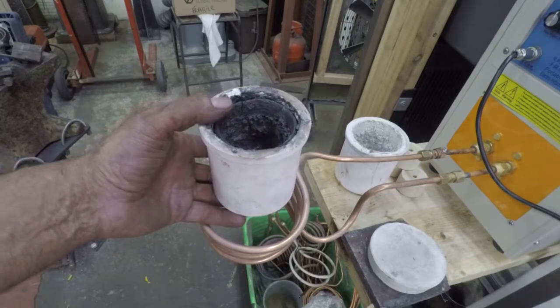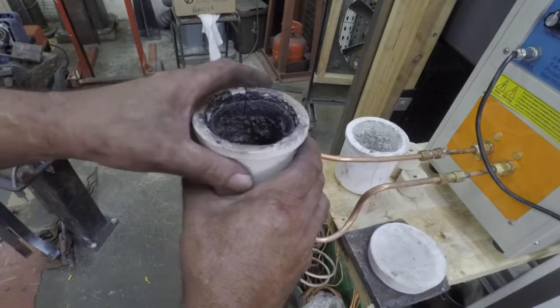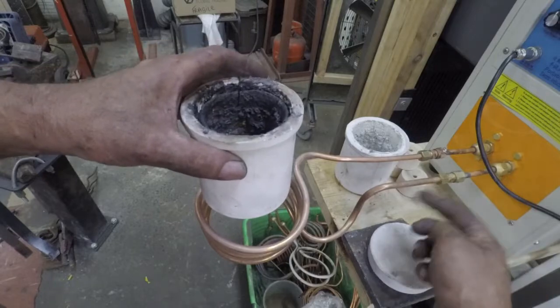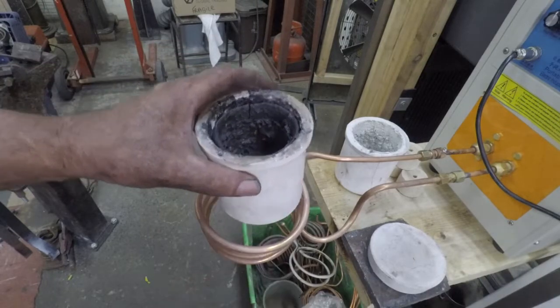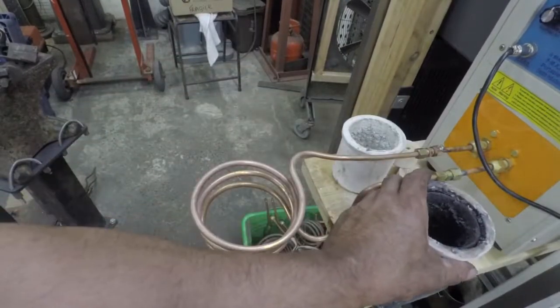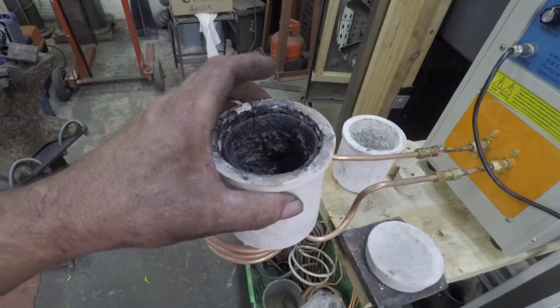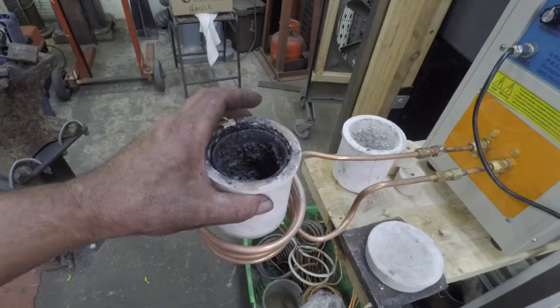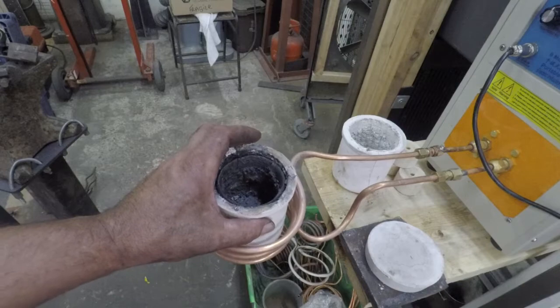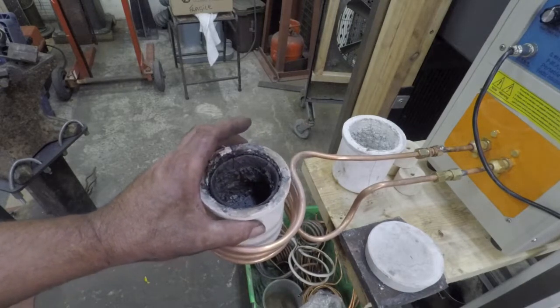When you're gripping the weight of a hot crucible full of molten iron quite near you — and the tilting crucible — you see them a lot with induction furnaces. But the flexible cable link here simply reduces the effect, which means taking longer, and the whole point of getting this is to quickly melt iron. It does one of those full of iron in about half an hour. If I could increase the volume to get my three kilo pour in an hour, that's still practically useful.